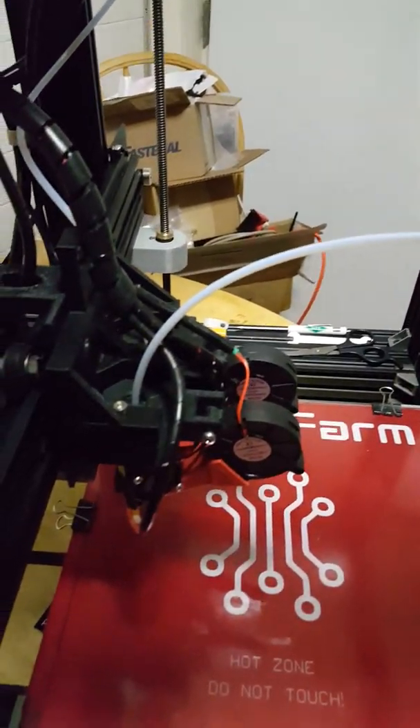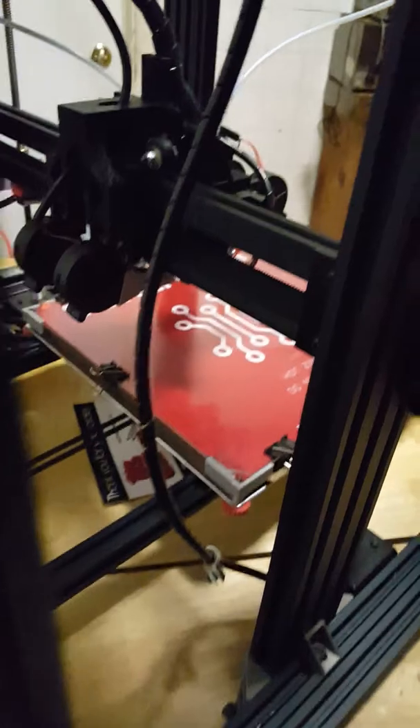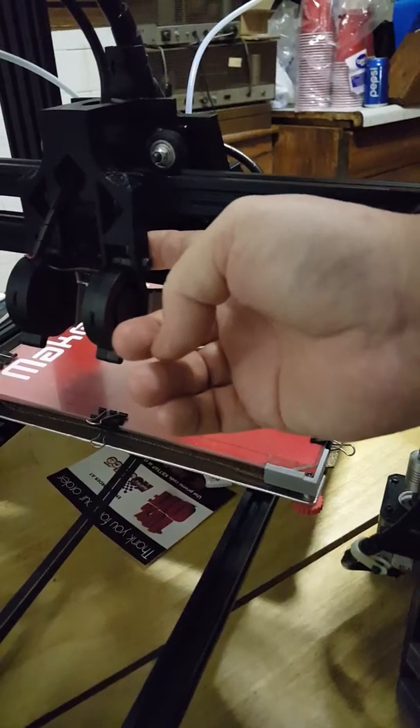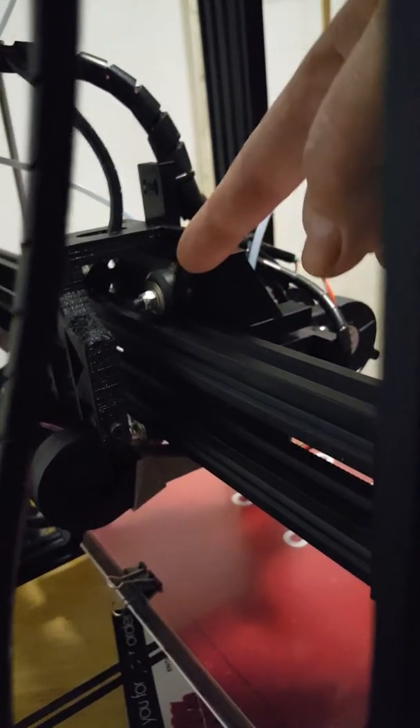Right now in its present configuration I might get a little bit more than that when I'm done. Here's the back half of the carriage and it's solid — real solid, does not flex a lot. The way it's mounted is it's sandwiched between the back plane, the metal back plane that the carriage mounts to, and the actual carriage itself. So this same setup would actually work on the Pegasus beautifully.